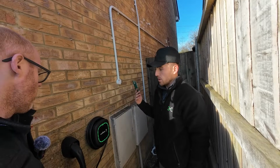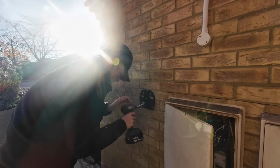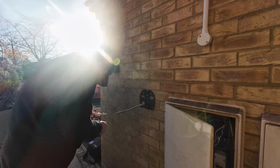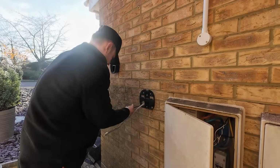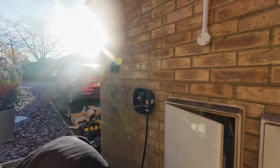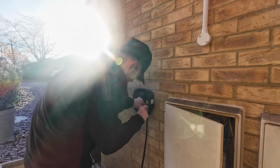Okay. So if you've got an extra amount of solar, instead of sending it back to the grid, the Wallbox charger will now be smart enough to know it can take as much solar as it can. So the CT clamp is obviously wired into that energy meter. Is that then wireless between the Wallbox and the energy meter? No, that's also wired. Okay. That is just wired with a standard Cat5 data cable. Right. Okay, great. So it's got a constant signal. You don't have to worry about it potentially dropping in and out. It's hardwired in, so that's the safest way.